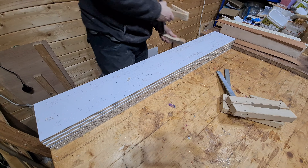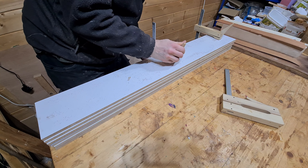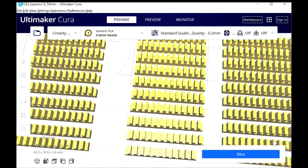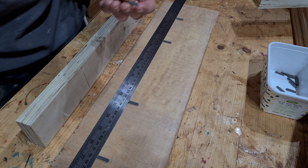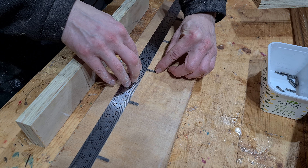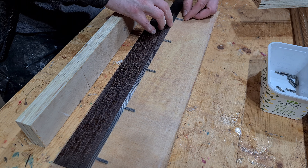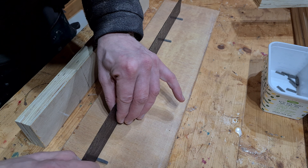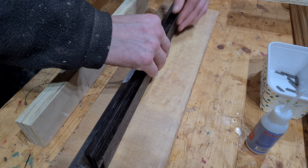I could see there was a better way of dealing with this process. So I went back, found some veneer at 0.74 millimeters in thickness, and sealed them prior to using them in the project. These were coated in epoxy resin and then cured whilst under compression on a flat surface. The widgets were 3D printed and had a spacing of 0.74 millimeters. Placing the strips was mostly okay, although a few were slightly thicker and required jiggling to fit. The more the widgets were used, the less deviation the layers would experience. It was important to check that each layer had gone into the correct spacing rather than its neighbor.